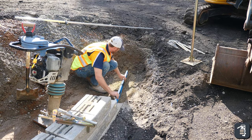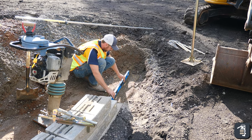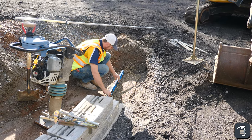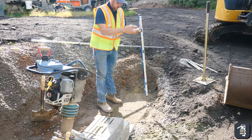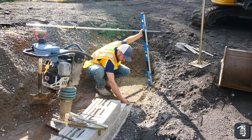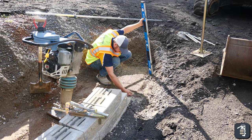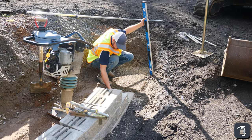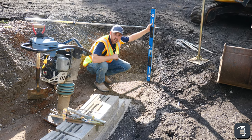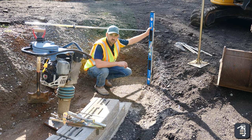Putting a little piece down on top of my wall — perfect, nice and dead level, staying parallel with my wall. Now what I'll do is I'll clean off my P-stone off the face and top of this wall — clean this off real good. Now I'm ready to continue to lay our wall block. You're going to see a little bit of an imperfection to start with, but as you keep building your retaining wall, there won't be any imperfection — it's going to be perfect every time.